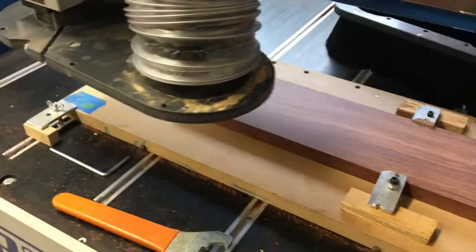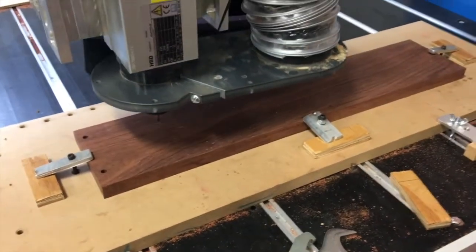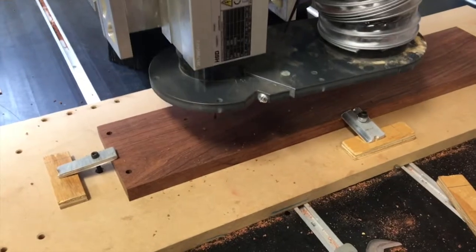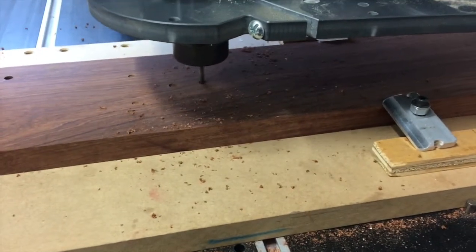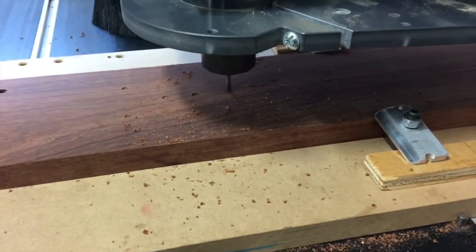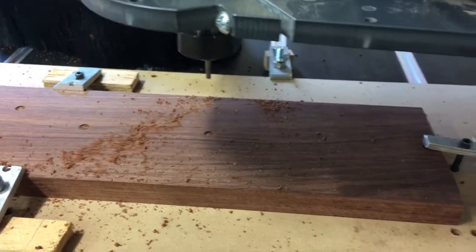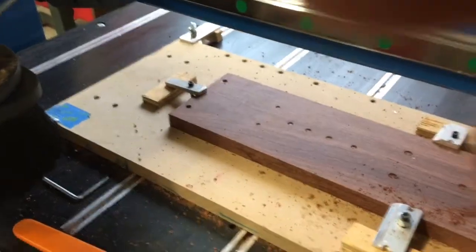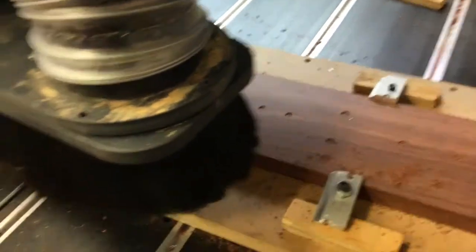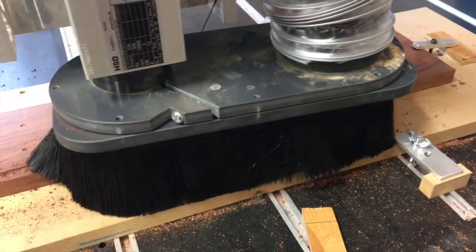We put the neck mounting holes in the bottom of all these blanks. And now we flip the board over, indexing it on our fixture. And now we're doing the fret markers. Just quick little tiny holes in the board to drop the little mother of pearl dots in. Now this is a groove that the neck binding will be attached into. It creates a lot of dust, so we're leaving the curtain on it.